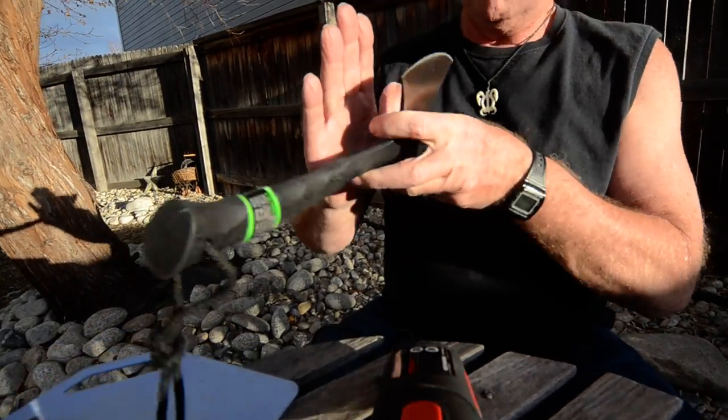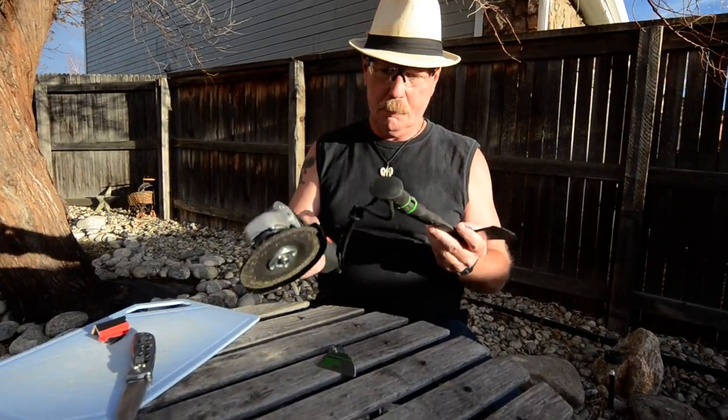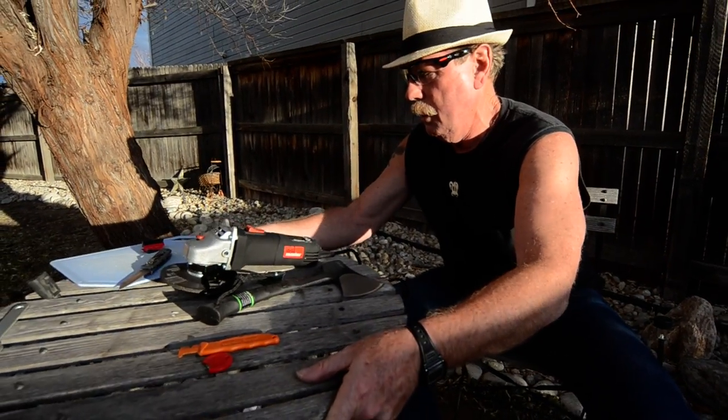So I'm going to reprofile it. I'm going to thin it down, take it down to about probably a 10-12 degree bevel like that, because I really want it to cut wood. And when you chop into something. So I'm going to use my grinder to do that, and let me reposition a little bit, move the table a little bit, okay,